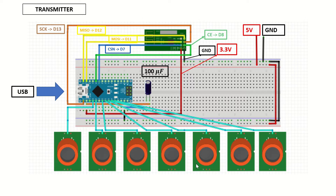The sensor modules are connected to the analog pins. In my setup, I had a problem soldering the A2 pin, so it's left blank. The seven sensor modules are connected in a row from A0 to A7, excluding A2. Note that the 5 volt and ground connections of the sensor modules are not shown in the diagram for simplicity — make sure they are connected to a 5 volt power supply properly. Also, connect the Arduino to USB power separately.